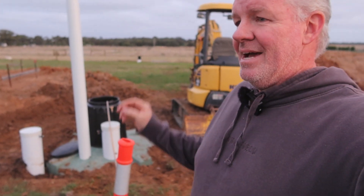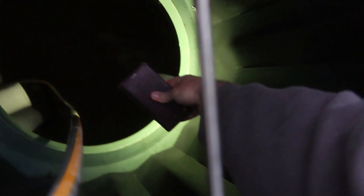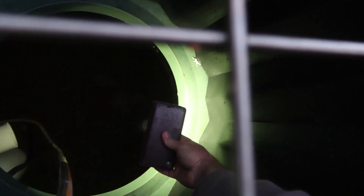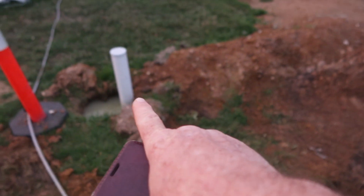That's what's been going on today — I didn't get time to do footage before or during the day, so I thought I'd come out now and show you where it's at. You can see just filling that up now. That pipe there coming out here will be hooked up to what comes out of the house — so it all comes out of the house, in there, down through here, into this pipe, does its thing down the bottom. This pump will then pump the water out to the effluent field. The house is there, we've got what will be the front yard here, and the effluent field will be over in this first paddock.